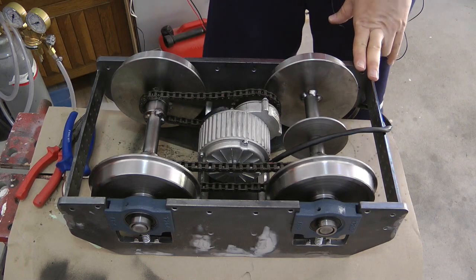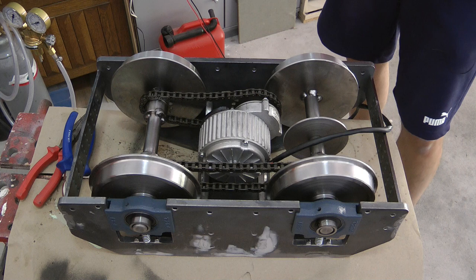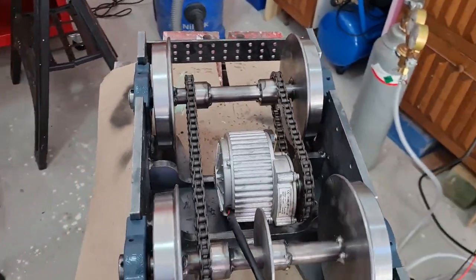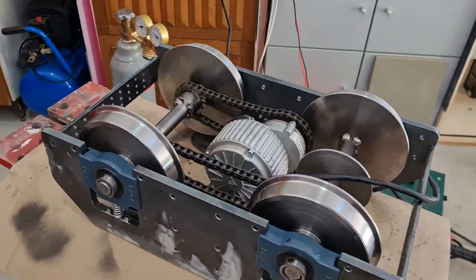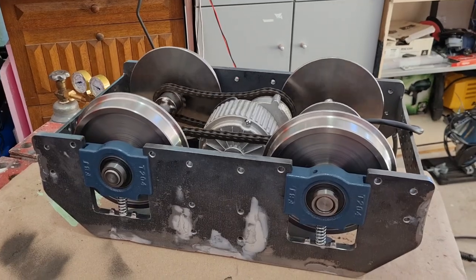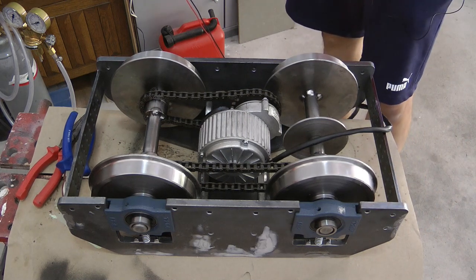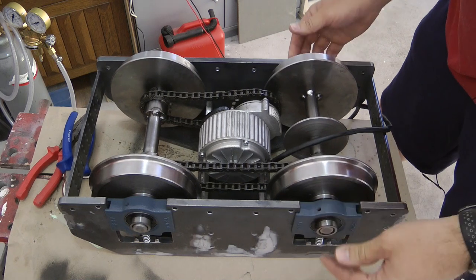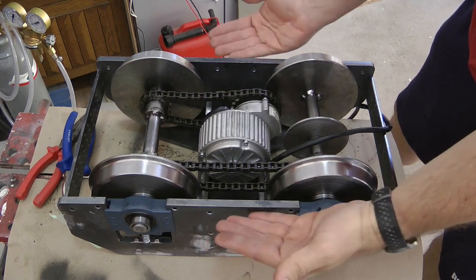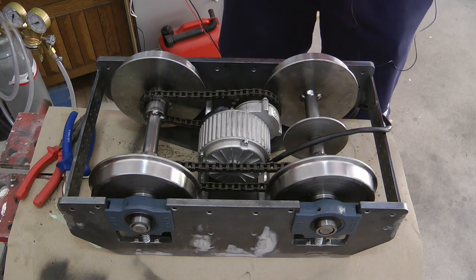I'll do another quick clip here with my phone so you can see that at the moment it is suspended on just a single spring, because I still need to get a proper spring — these springs are too heavy. I can push it down, but I think under the weight of the loco that's too much. I have places for three springs here, and I think three springs would be better than one because that would keep the bearing blocks from rocking side to side, keeping everything more in plane.